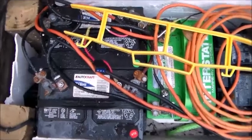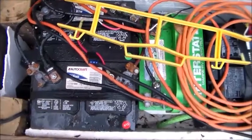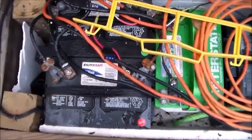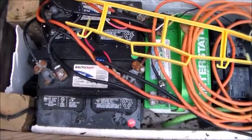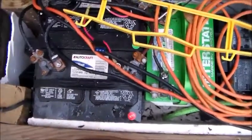That's just how it is. For instance, you turn on your power inverter and it drops below 11 volts — it's going to cut off your battery power. Even though your battery may actually be 12 volts resting voltage, if you turn your power inverter on and it drops it below 11, it will cut off your power.